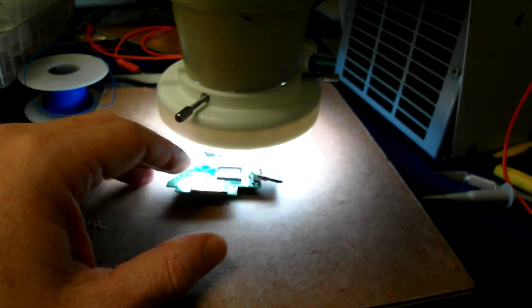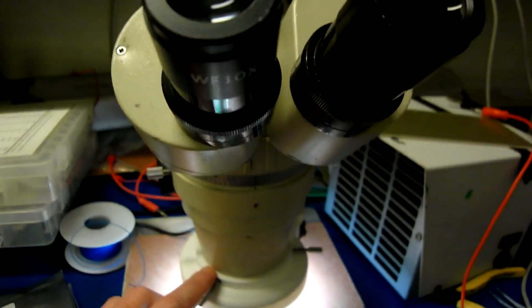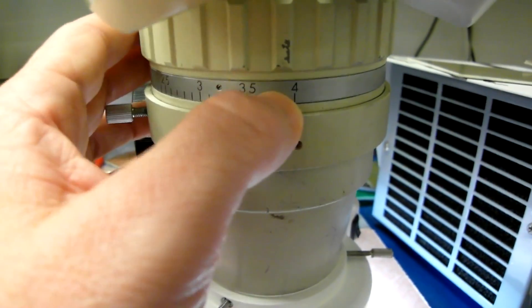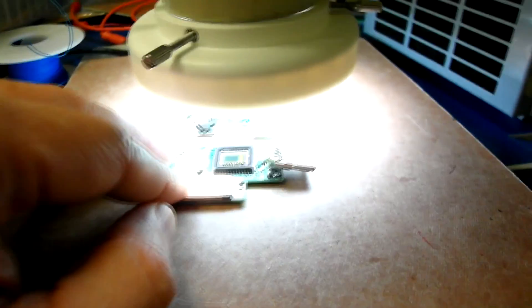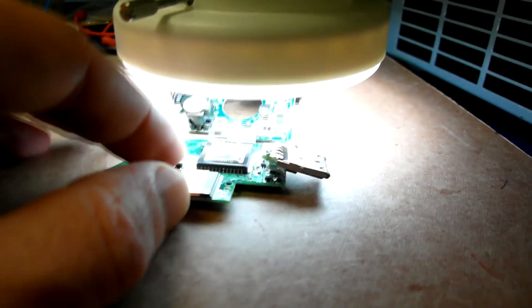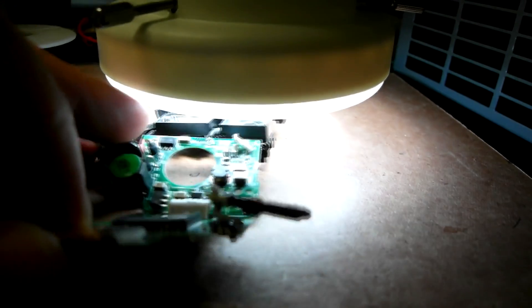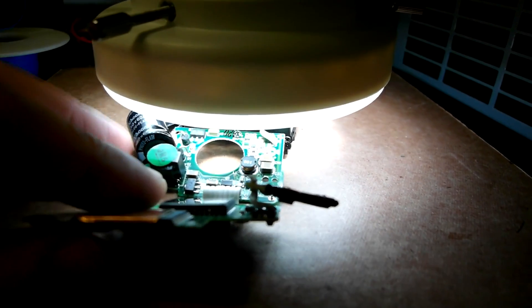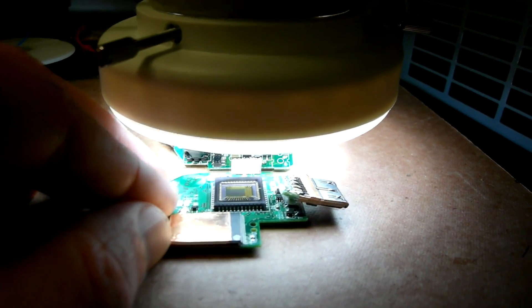That's the highest magnification I've got here. I've got my x2 Barlow lens, my x10 eyepieces, and my x4 zoom on here. So that gives a total zoom of 80 times. You'll see the very small working distance I've got here — it's really tiny. The lens is up there a bit further. We're only talking about 25mm working distance or something like that under this microscope with that x2 Barlow lens.